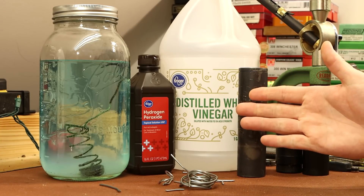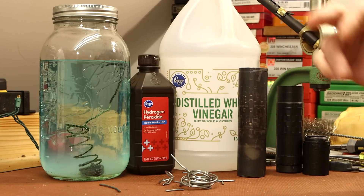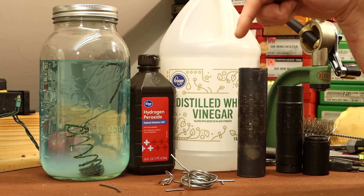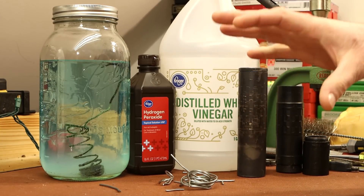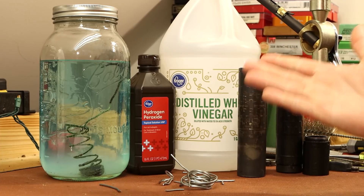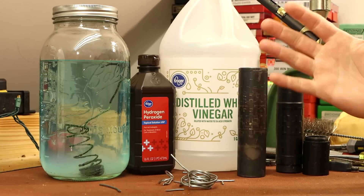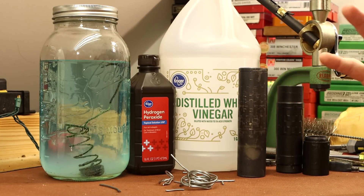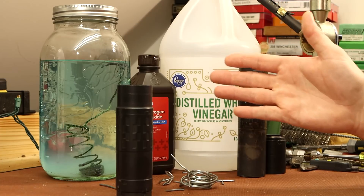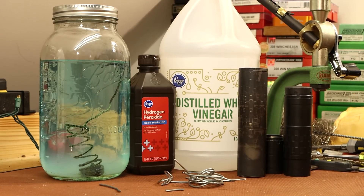My plan going forward is to have a five-gallon plastic bucket with a nice layer of zinc wheel weights on the bottom. I do my dip and then just pour it in there, put the lid on, and call it done. Now there's hydrogen gas being produced, so you don't want to seal it up completely. I'm thinking of cutting out the very center of the lid so that if it tipped over it wouldn't spill as long as you kept it less than half empty — but it still allows air exchange. Then over time, once it evaporates off, you glove up, maybe put on the hazmat suit, get in there and scrape all the crap off your zinc, collect up all the dry powdery junk, and seal it for easier disposal. I bought another suppressor recently, and I'm thinking maybe a once-a-year dip is going to be worth the time and trouble — because listen, it can be dangerous, but it seems a little less dangerous when we throw some zinc at it.